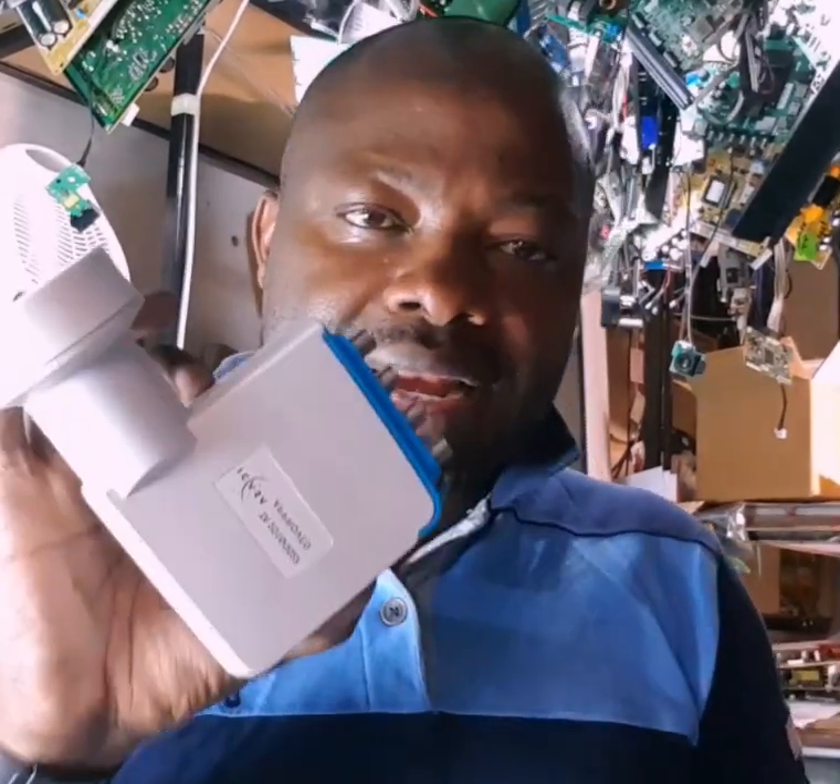One decoder may not have a signal, or one decoder will go off and reboot because it doesn't have proper communication. I'm just trying to bring your attention to understand that if you are using a smart LNB and DSTV Explorer decoders — one, two, or three — you have to bear in mind that your configuration must be well done. You must respect the user band, the type of user band, and the index of user band you are using on each decoder.